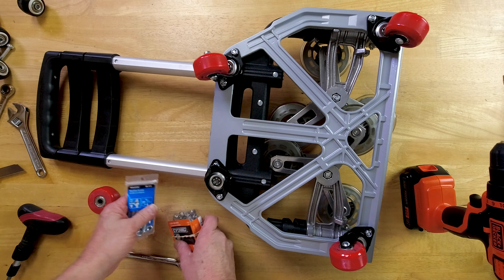I'm going to use one-quarter-inch-20, one-and-a-half-inch long bolts and some lock nuts to replace the hardware, which I think was three-sixteenths. This is a five-sixteenths-inch hole and you're putting in a quarter-inch screw, so you need a spacer — and the spacers are pretty easy to make.